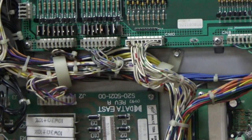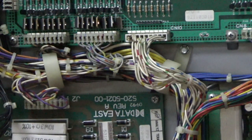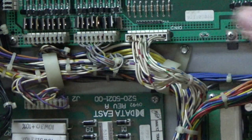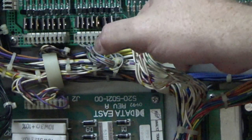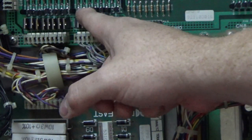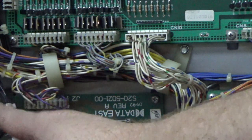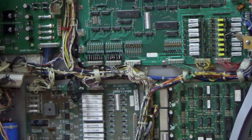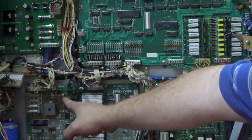All right. So on the bottom of the CPU board, you have this row of TIP 102 and TIP 122 transistors. So the way this works is there is a peripheral interface adapter, a 6821 up higher, that tells some logic chips to turn on this little pre-driver transistor, which then tells the bigger transistor to turn on, which then connects ground through these cords down to this board. I don't know if you can see the board below it. The board below it there. Right? So PIA, logic chips, pre-driver transistors, second pre-driver transistor, large transistors.